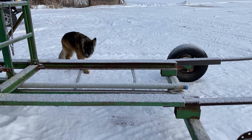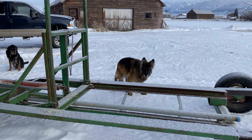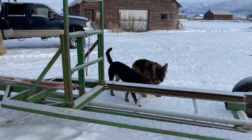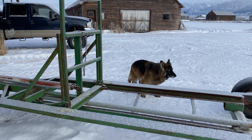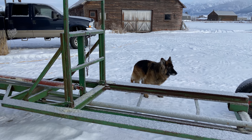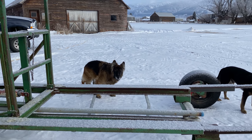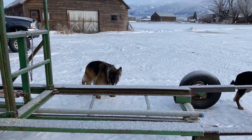And the ram, you'd put the bale down on the center of the feeder, or the bagger at the time, and the hydraulic ram would push the bale into the drum, and the drum would then fill up the bags with round bales. You'd put the tractor in neutral, and when you push the bales backwards, it would actually push the tractor forward for the length of the bale.